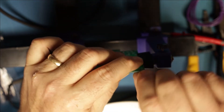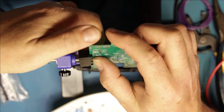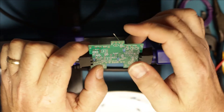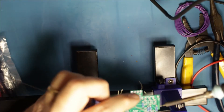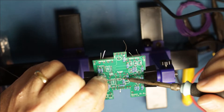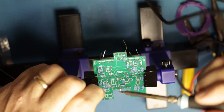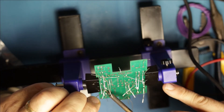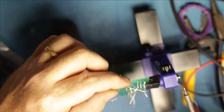There's the transistor, that's a 360 ohm resistor - lock that right in, start getting them lined up. I'll just tack the backside: 2.3k, 2.3 kilo ohms. Since this is audio circuits, I'm guessing we should keep the leads as short as possible, make sure they're really pressed up against the board and pulled in tight. I solder them from the top first - they'll have a better grasp when I do the real solder from the bottom. I'll tack them top and bottom to really hold it to the board - heat longevity, keep them planted.